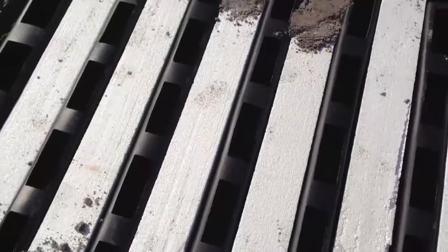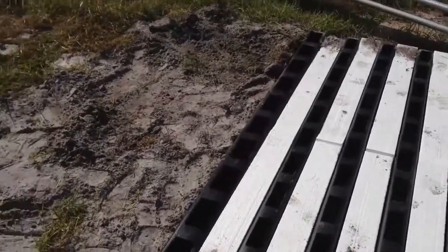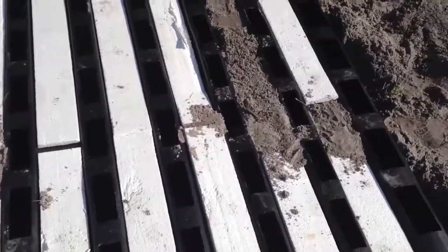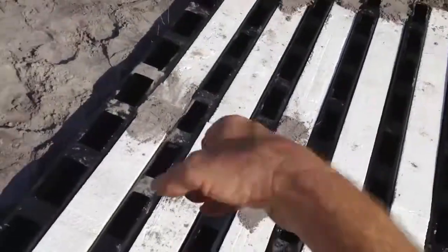These foam tabs are just the gap areas. After we pour, we'll throw them away. If you don't use a pump machine, just pour the concrete on top. Now, what you want to do is make sure you pour the concrete all at once as you come up. So you put a little bit in each beam as you're going up. Same way on this side. Don't just do one beam and then the next beam. You want to do a little bit, little bit, little bit, little bit.